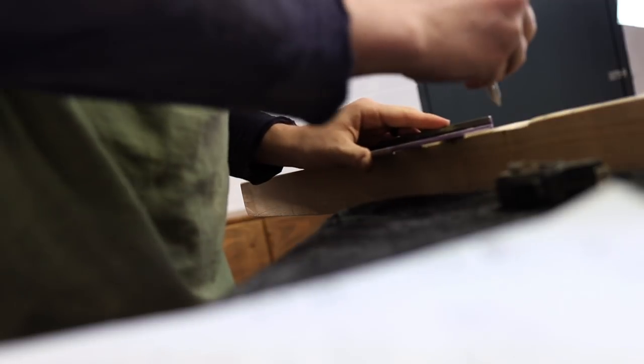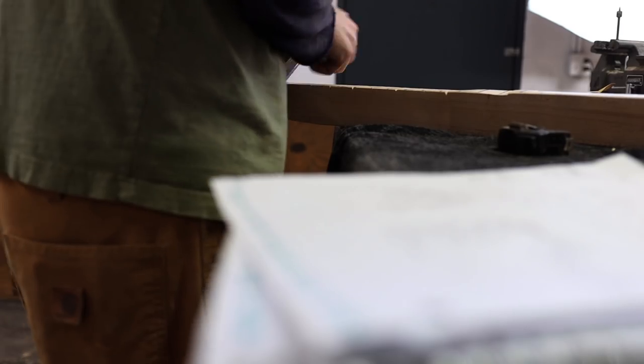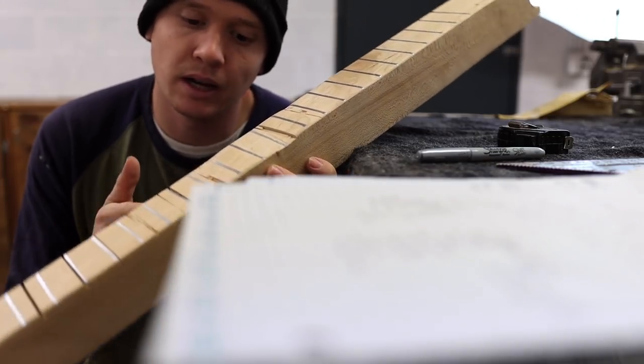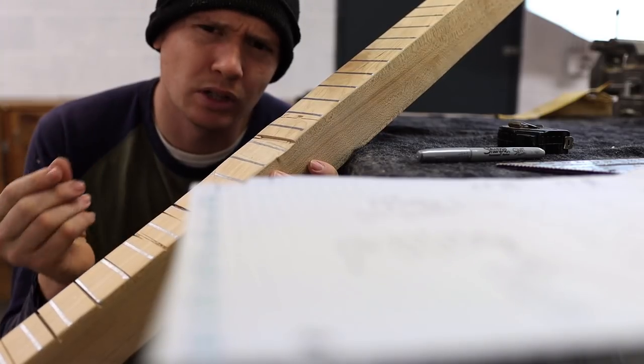Another pro to the tillering stick or tillering board is that it's really portable - it's just this one thing and you can put it in a vise, set it down on a table, draw it, pick it up and look at it. So if you have a small space or you're going to go somewhere and build a bow, it's really portable and really easy to make out of just one board. We've got all our marks marked out and I'm going to take this over to my chop saw, set a depth stop on it so I can cut maybe the width of two saw blades for each notch. I'll start at six inches and work my way down.